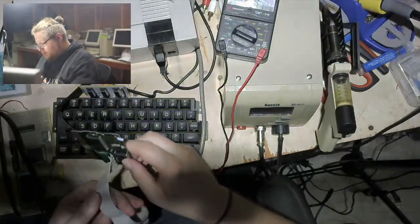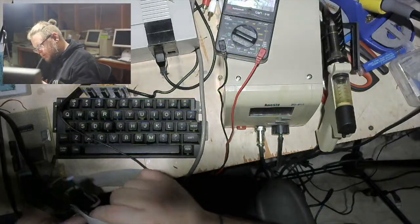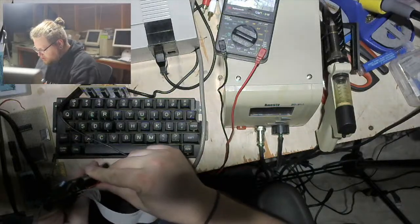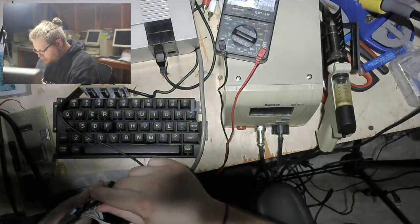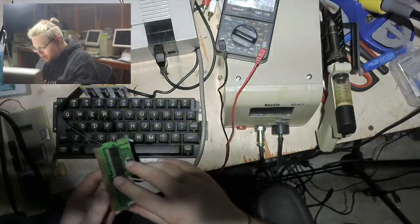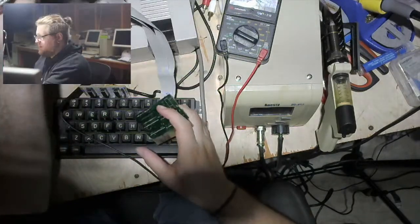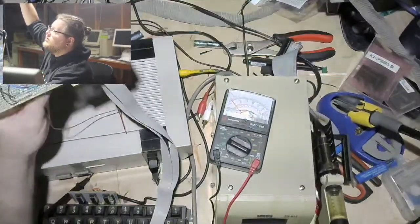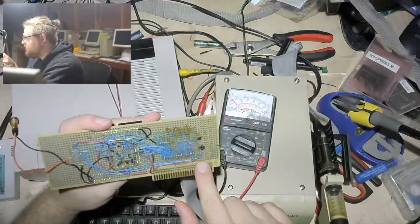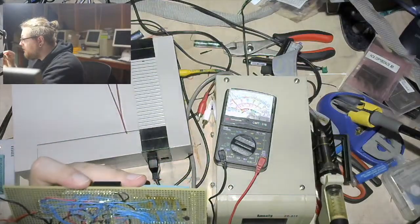Okie dokie. So, I'll actually need two wires because I need to run one back for the SRAM chip select. And I'm going to flatten this out just a touch, and try not to break the pin, but whatever. But also, we can worry about running that wire back later. Let me see which ones I used for what. I have to angle this thing back again, because I just can't keep it together. So, the top three pins over here are all 5 volts, and...